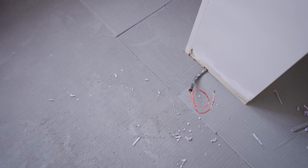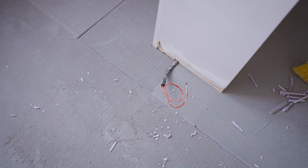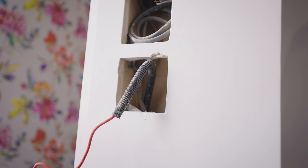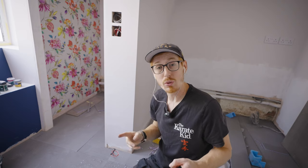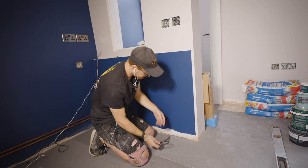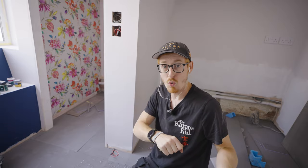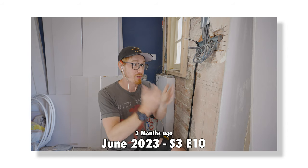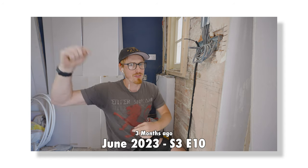This black tube is hidden behind this freshly plastered and painted wall. The reason for that is because I knew we were going to be putting underfloor heating down and you need to get cables from the underfloor heating up through the wall to the thermostat. We've got one here and another one on the other side of the room. That is preparation — knowing I was going to be installing the underfloor heating. Doing prep work like this means your future self is just going to thank you because you've prepared things to make them easier later.